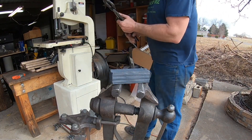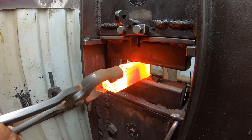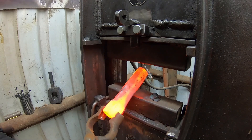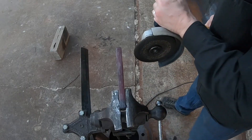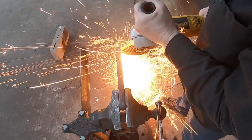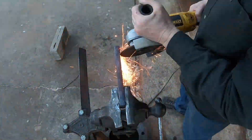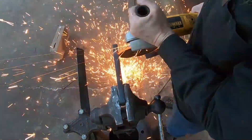You'll see a solid chunk of steel and it looks pretty good so far. A lot of times with canisters you'll have cracking on the corners, but with all these little steel rods in there it really helps with the linear tension when you're forging it all together and keeps things nice and solid. We've got this forged down into a flat bar — still pretty thick — and I'm going to grind some grooves into this billet to introduce more patterning in our final product.